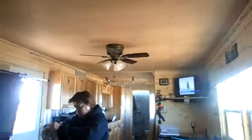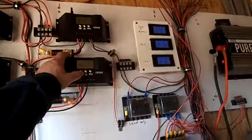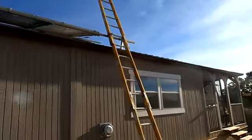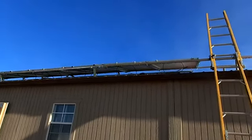We need to turn off the bathroom light — go in there and get that done. It was a nice break yesterday, not doing anything. Bathroom light's off. And we should be down quite a bit on DC — yeah, 0.71 amps on DC. All the security cameras are running now and all the little wall warts are drawing a little bit also, so we're using 0.71 amps. Everything's ready to roll on the roof — all we have to do is put the panel up and plug it in. The ladder is going to be interesting this time, and then I have to fasten down the conduit.